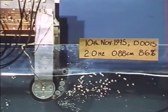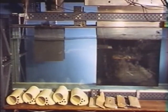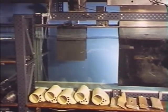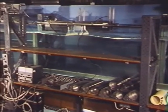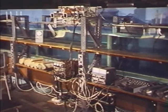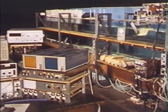You can see the ends of round rods that we poke through. Now we've got an array of early duck models and a later model of wave maker. This was a prototype of one of the units in the wide tank. It's got a wave straightener in front of it. And now you can see a pair of wave gauges in the top middle of the picture, a quarter of a wavelength apart, used to measure standing wave ratio.